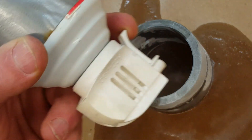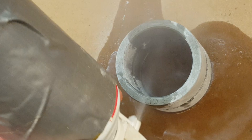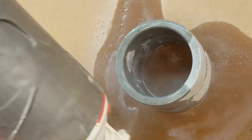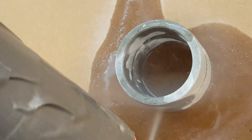Now, this is not this chemical's intended purpose. You've probably already guessed — it's air duster for computers. If we turn it upside down, the solvent comes out and it flashes off at such a low temperature that it cools the part.